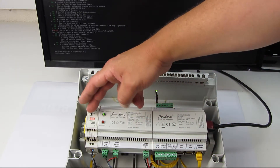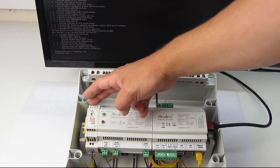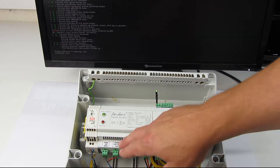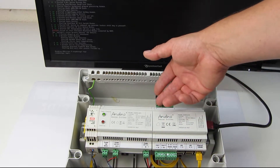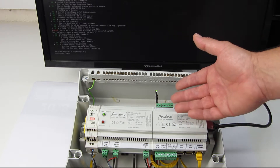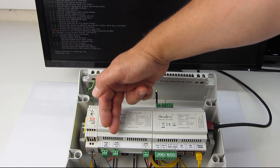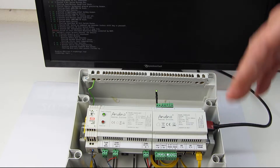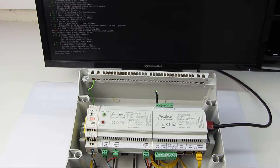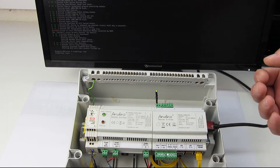The wiring is: we have a power supply here with an input of 220 volts and output of 24 volts. The output goes to the input of the micro UPS, and the output of the micro UPS goes to — in this case — the Andino X1, which has a 24 volt input. Inside is a Raspberry Pi. You can source every control unit with an input of 24 volts. So we use 24 volts as input and 24 volts as output — no loss in transforming the power up and down, unlike bigger UPS systems that transform up to 220 volts and back down to 24 volts.